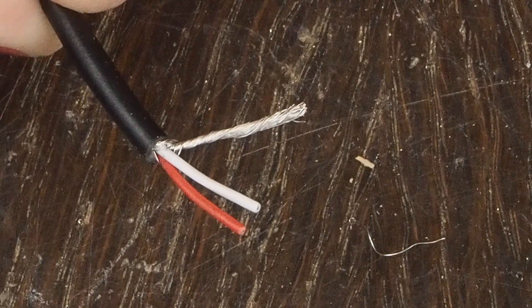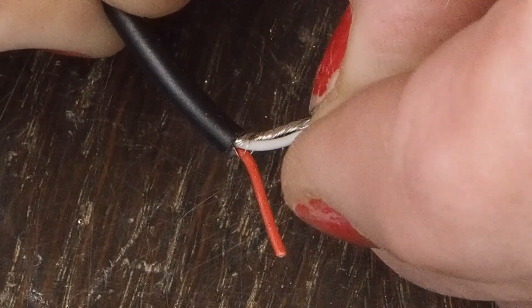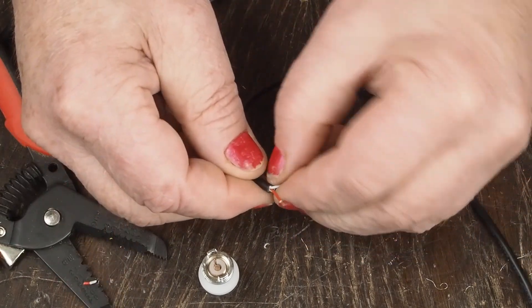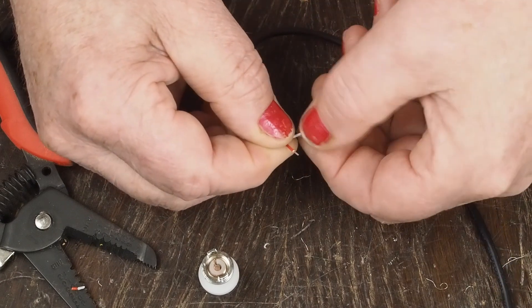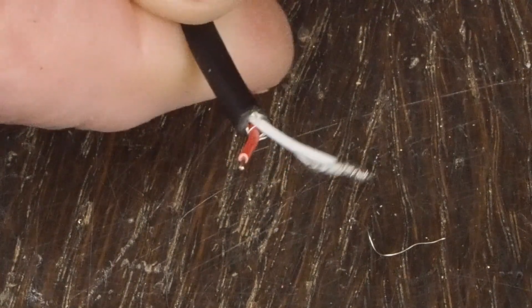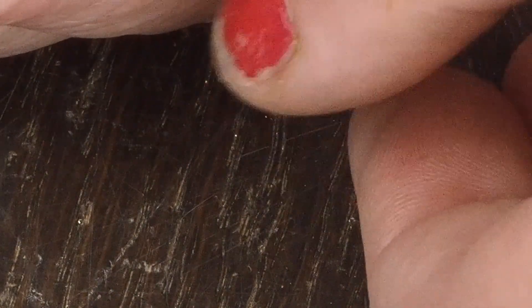What we want to do is pull this stuff around and find the white wire, because that's going to be our ground — we're going to be combining the shield with that white wire. Pull these little strands around to the side of the pair that is the white ground wire and twist them up, so we end up with white, red, and the shield. We're going to strip these back now, and these two are going to get connected together on the amplifier end. Make sure none of these little whiskers are loose where they could get into the positive, because all it takes is one whisker and you'll have a short with no signal going into your amp.